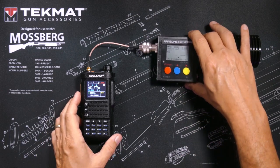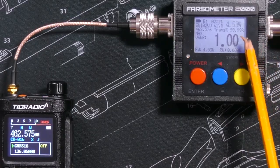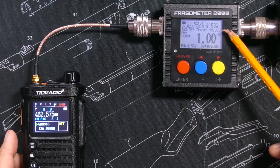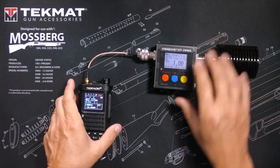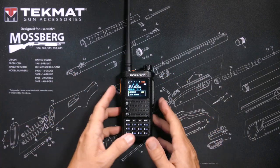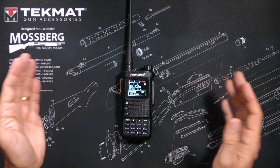The box says this should be a 5-watt radio. Let's test that. As you can see, this radio is outputting 4.53 watts — very close to the 5 watts as expected, and closer to 5 watts than most 5-watt radios actually output. So this radio is outputting almost exactly 5 watts, and 4 or 5 watts is just fine.